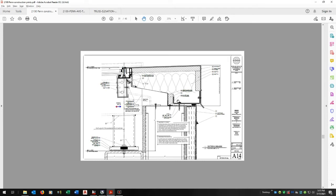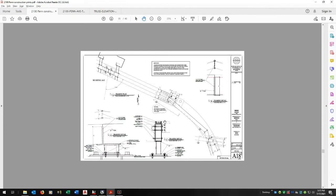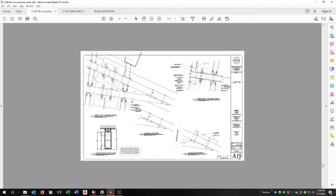The detailing here is the same as the other stuff — parts of it are segmented and parts like on page 15 are welded pieces to be curved, but the same basic idea. The connections underneath are weird, we'll get to those. These are the connections — again, everything should be shop-made. You guys just have a bunch of twisted bars with funny plates on them and they're all detailed there. We're working from the steel so I think we're pretty good — everything should land. These are a lot taken from their model and then our connections shoehorned in between everything; it gets a little crowded.